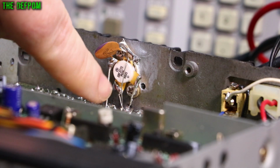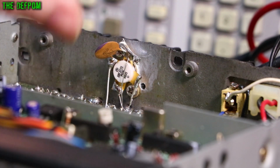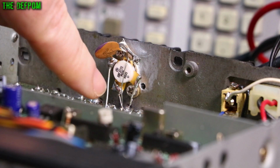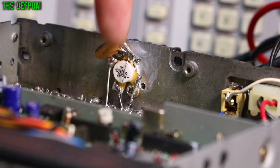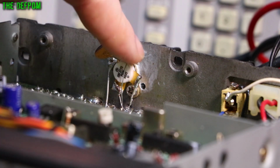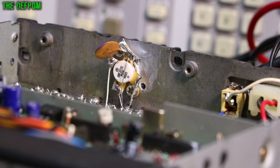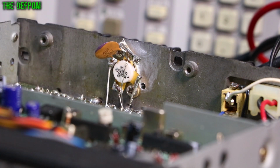I've got the 0 volt rail there on each side of it, the left and right sides because it's sideways. They're both 0 volts, and they go to the centre track. And I've actually got a wire coming up as well. It's also linked onto the back panel, so you have to link both of those terminals. You can't just do one, even though you measure across them and go, okay, it's the same connection. It's not. You have to wire both of them, otherwise you don't generate the full power.